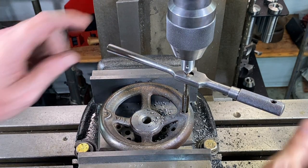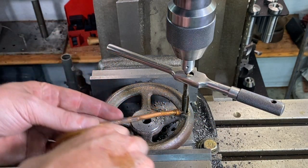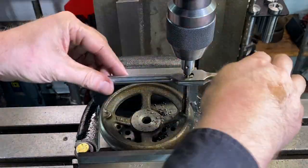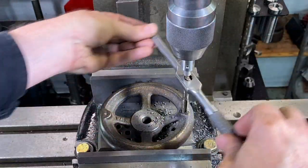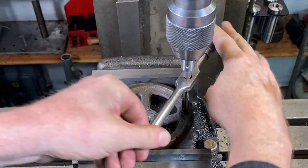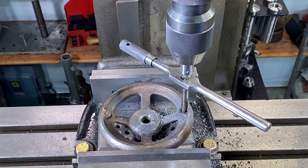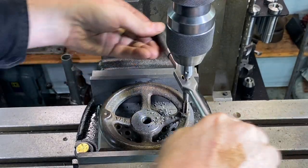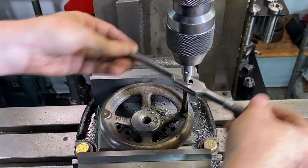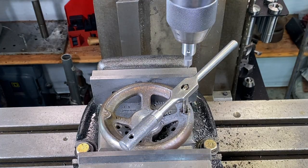All right, I got the 3/8-16 and my nice Starrett tap handle here. I'm just gonna give a couple of little shots of rapid tap here. You know, I know we're in some cast iron, but it's nice just to give it a little shot there. So this should tap nice and smooth. Yeah, that's cutting no problem. And this tap follower seems to be working just great. And I'll lower that down a little bit there. Yeah, cutting like butter there. All right, I can let off of this tap follower here. That's in there real nice now.